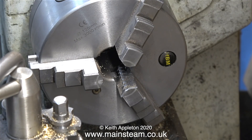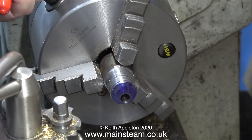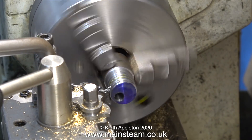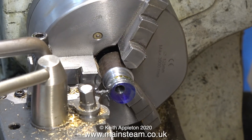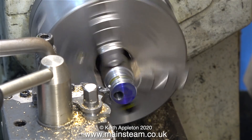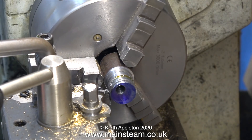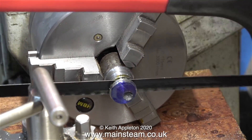And that's it for the four-jaw work, so I'll refit my three-jaw self-centring chuck. First of all I'm going to show you something which is very wrong. Here I am at my lathe, and what I need to do now is part off one of the eccentric sheaves. This is a very bad thing to do, but I thought I would show you how to do it. As soon as the parting tool breaks through into the eccentric hole it jams solid — I'll show that again in slow motion. The reason the tool post seems to move is because it's actually lifting the entire saddle off the bed slightly. I would not normally show this, particularly if the lathe was more powerful, but as the drive belts are slack there's no great damage done.